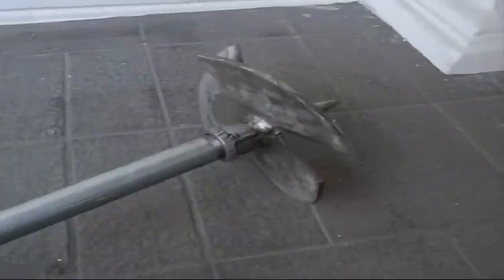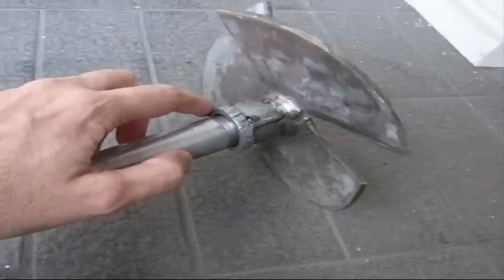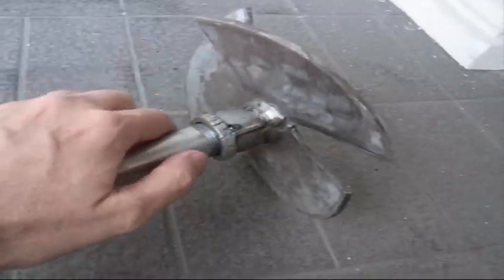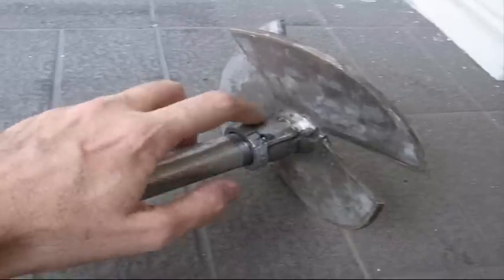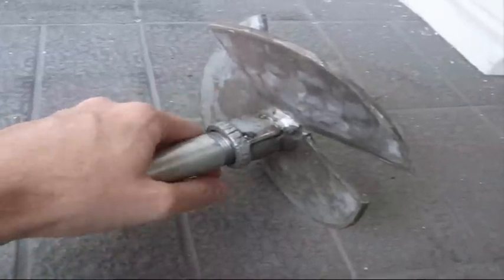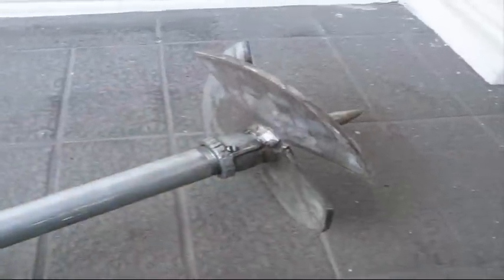Let's go down here and take a look at the business end. This is a three-quarter inch pipe fitting — again the nail with a split in it to hold it in place. One of the hard parts was holding this thing square to this. It took a lot of fussing around and measuring. Finally I just trusted that this would be flat on here and welded it up. Tacked it on there and checked it. The best I could do was that it was good enough. So I welded that all around.